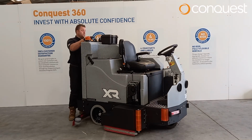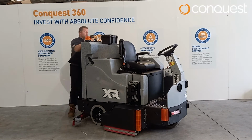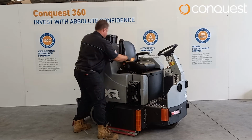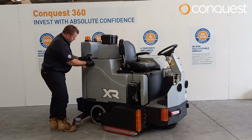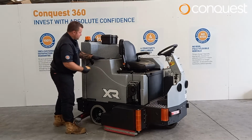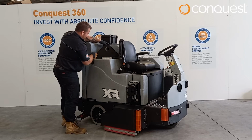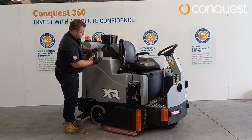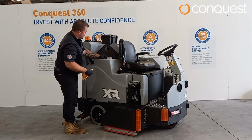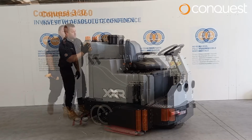Once a week, you should also perform a detailed inspection of the solution tank. Check the tank for damage or any scratches that could possibly cause leaks. Check the front fill solution screen port and make sure the solution cover and stainless steel screen are clean and in good working condition. Check your tank lanyard for damage or wear as shown.